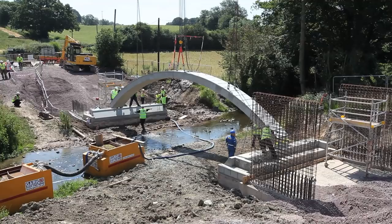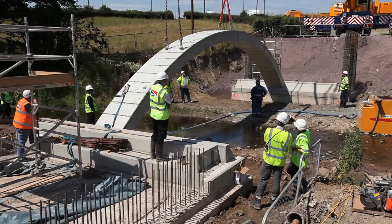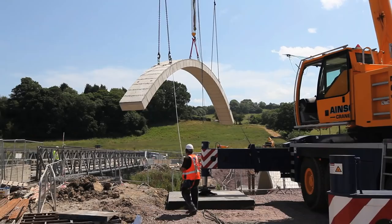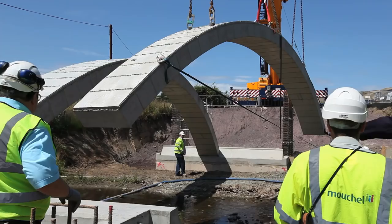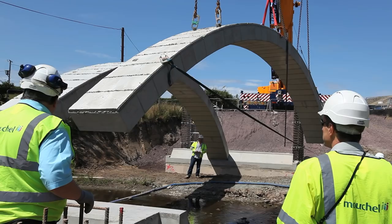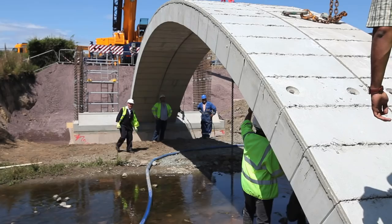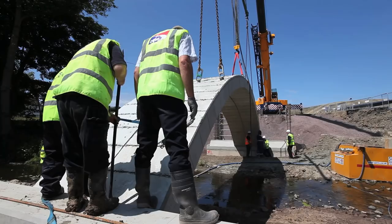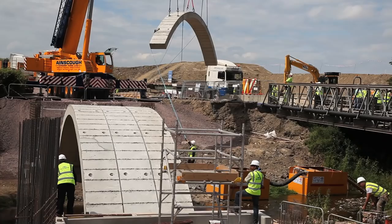The bridge is built from six flexible archring units. Each unit is made up of 35 tapered precast blocks. The individual blocks are linked in a flat strip by a flexible membrane bonded on top, which lets the archring fall into shape as it's lifted from the transporter. The archrings can be made to form spans from as little as 3 metres up to 15 metres, with longer spans, skew spans and double arch radius spans in the future.